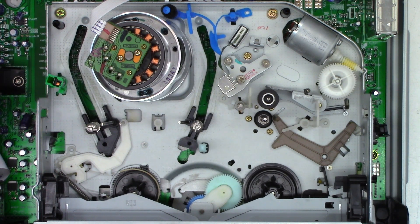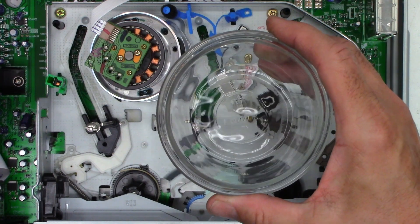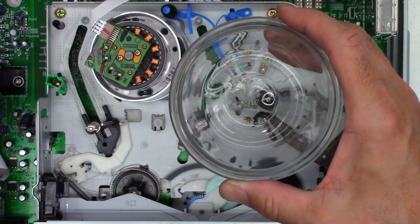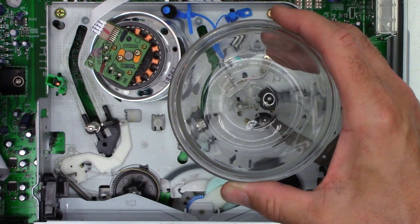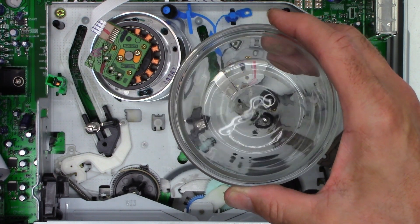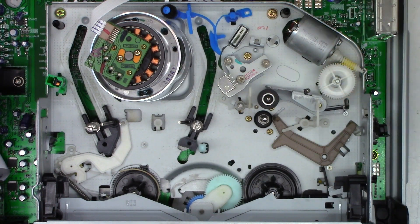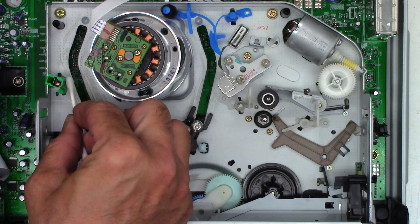A little bit of explanation on the VCR tape transport. Let's go ahead and get into cleaning. I have my pyrex dish with acetone — I've already cleaned it out, put just a small amount in, maybe a quarter ounce, then wiped it out with a paper towel inside and out. I do not double-dip in this — it's a single dip only, that way it ensures fresh acetone all the time.